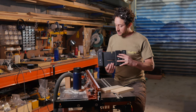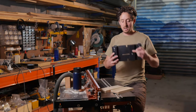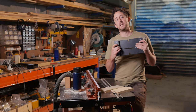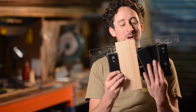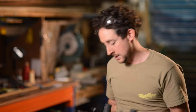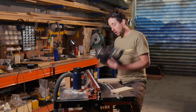The body of this thing is heavy duty plastic or some sort of resin, and you've got this sliding block which is what actually holds your timber in place and holds it square to the fence. The sliding block on one side has a strip of sandpaper stuck to it, and the reference block on the rear side of the jig also has sandpaper. When you place your work inside the jig, close it, and tighten it up, it's held in place by those sandpaper surfaces as well as the clamping pressure from the sliding block. So the plastic strip holds it against the fence, and the two blocks hold your work square.